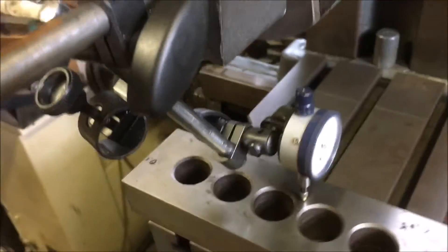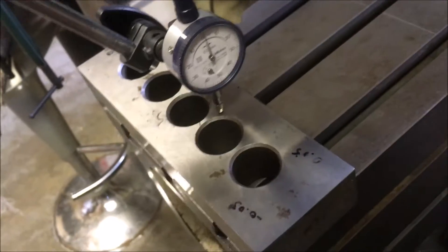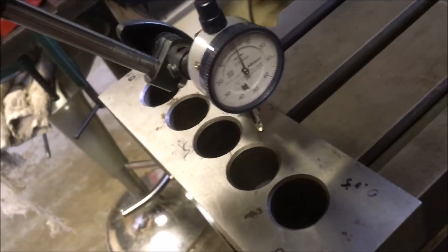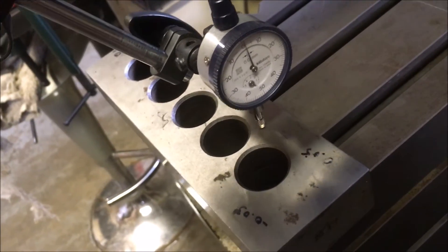It's square on the back, never having adjusted it. And zero runout now that way, whereas I had 5 thou over the full travel which is just over 10 inches.